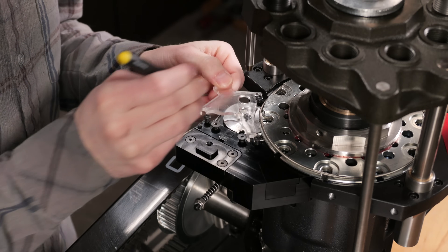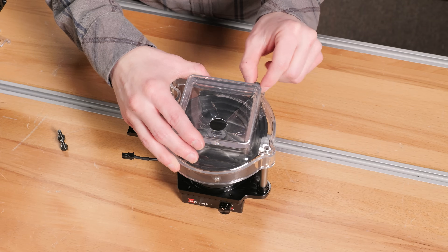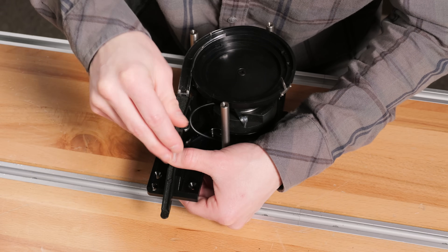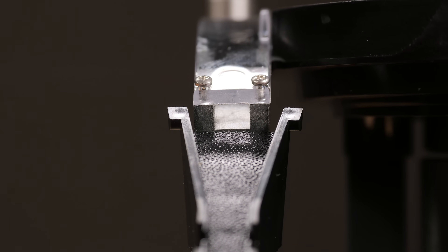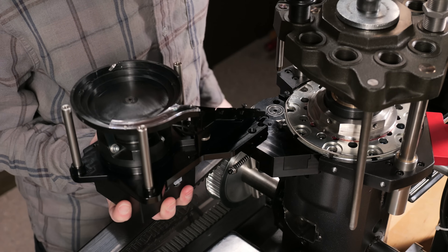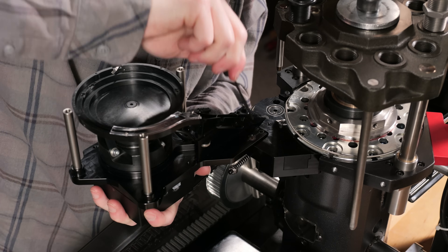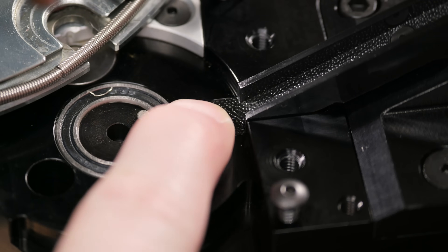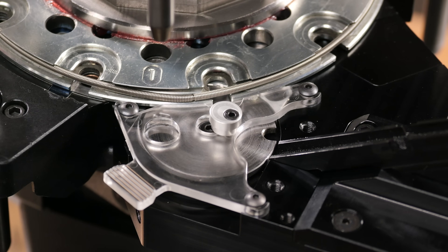All you have to do is uninstall the primer disc cover and the primer disc to give you some room, then move over to the unit and install the primer ramp with the little countersink screws. Adjust the ramp to make sure it's flush with the base, and pay attention that there's a gap — mind the gap — so it doesn't touch the primer assembly itself, as that could cause issues. Then you install the whole unit, push up on it a little while tightening down the screws so it's attached to the Gen 2.